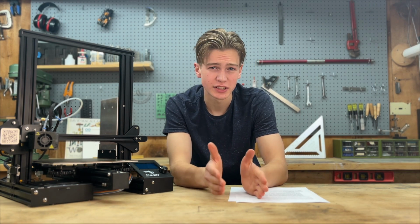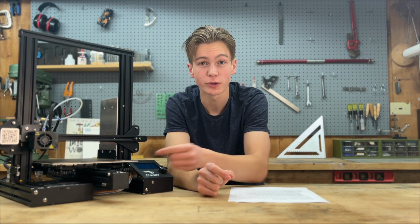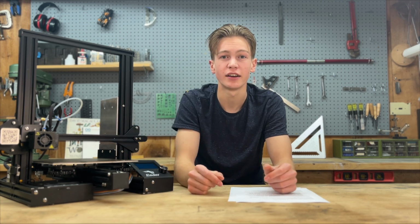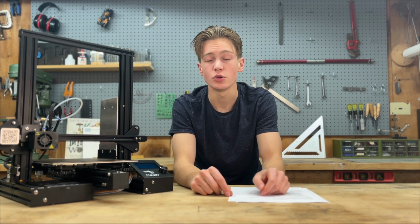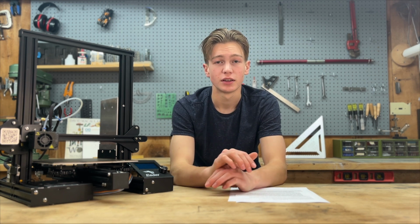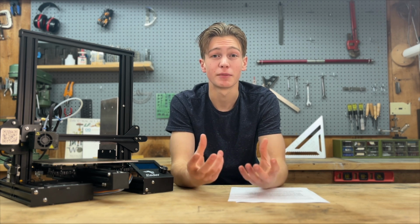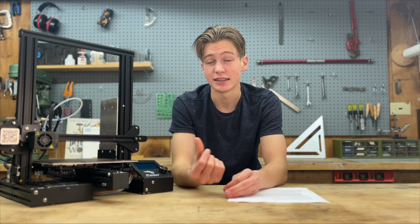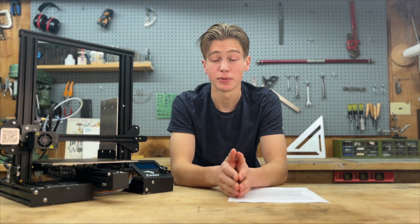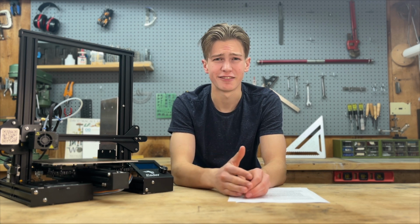Now, when you're actually printing this, you can make micro adjustments as you go. You can spin this wheel a little bit if you notice it's a little too low on this side, or a little too high on this side, or just something doesn't look right. You can make micro tweaks because, especially on a model like this, it's very, very low stakes. You're not printing something to have the print. You're printing something to calibrate the printer. So don't worry about messing something up. Just make very, very minor tweaks, and they're going to make big differences.